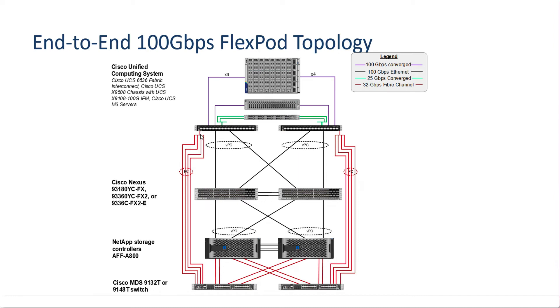We also have optional fiber channel connectivity on the outside, done via breakout from the fabric interconnect — a 128 gigabit to 4 by 32 gig fiber channel connection. These four connections are port channeled and go to our Cisco MDS 9132T switches, giving us 128 gigabits per second on each side. Our NetApp storage controllers connect to the MDS switches with the same bandwidth: four 32 gig connections, or 128 gigabits per second, to the two MDS switching fabrics.